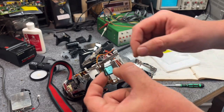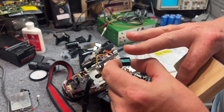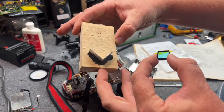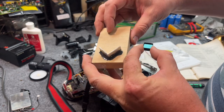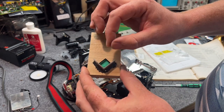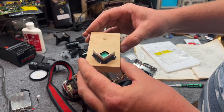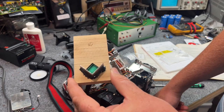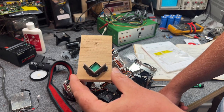What I use to re-cement it is Norland 61 — UV-curing optical cement. I reline all the pieces the way they were and use a little jig I made from L-shaped aluminum stock JB-welded to a board, tilted at an angle, to hold everything in place while I apply the cement. Once the pieces are stacked with no air bubbles, I very carefully walk outside — don't do this near a window or it'll cure prematurely — and after maybe half an hour maximum it's solid as a rock and it's never coming apart again.